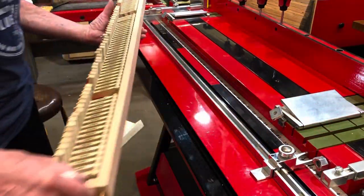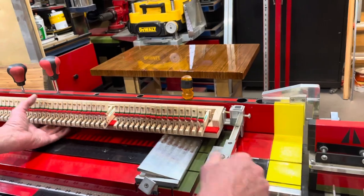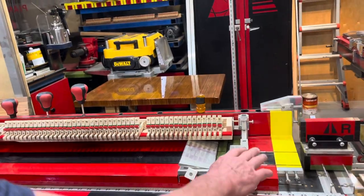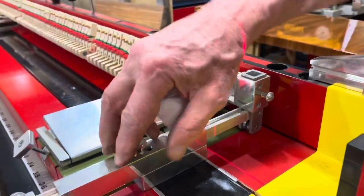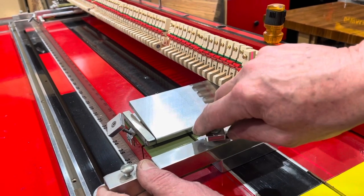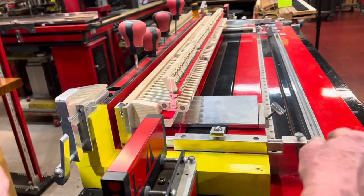How we do it — we got special moving rods here that we can place our stack on. We place it and just lock it. We place our stack on the moving arms — you see these arms, they move in the channel. We put our laser beam, and we open our moving channel. We just place it in the center of the pin and lock it. Same, we do it on the other side, and we just place our damper action so that our beam goes through the center and lock it.